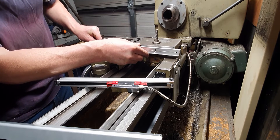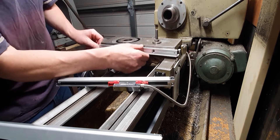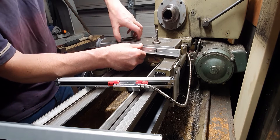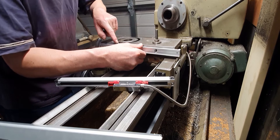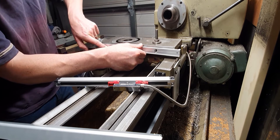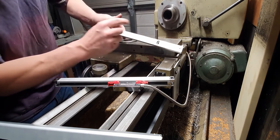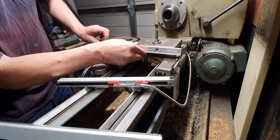Machine-wise, the scale is going to sit here, but this fixing here is going to come straight through to where the compound slide sits in, and I've got no meat at all here to screw into. So this hole I'm going to relocate over to here and use that as the fix - the back one's fine. Anyway, we'll machine that first and then drill and tap those holes.